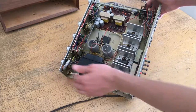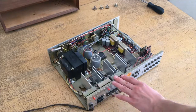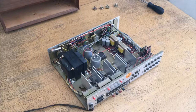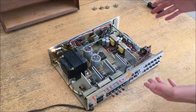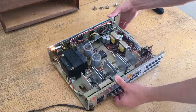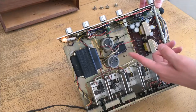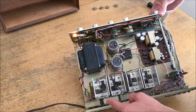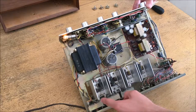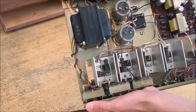There's also a little light bulb for the indicator on the front. I'll plug it in so you can see the light turn on — and as you can see, the bulb has lit and the amplifier is powered. It doesn't look much different when powered on; the light being on is the only major difference. I do want to be careful of this particular junction here because that is the mains at 120 volts, and it's about 2 or 3 millimeters from the heat sink's heat spreader — definitely a good idea not to flex the chassis too much.